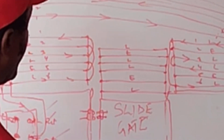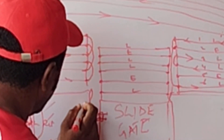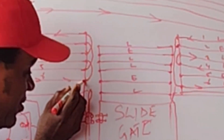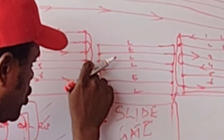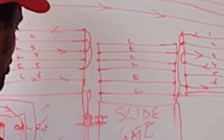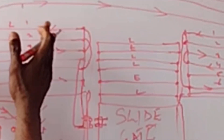This part goes back like what I explained in the first image. So now what we'll do here is we're only taking our live. What I need to do is take this one line - I'll take this one from here. Now if I'm taking it to this live, watch - there's a trick here. Watch this trick. I'm putting this thing here at number six. Now take a look at this close loop here: I will need to remove the jumper I've used in looping this. I will open this up, take it away so that this circuit is opened, then I will take from here to the gate contact.